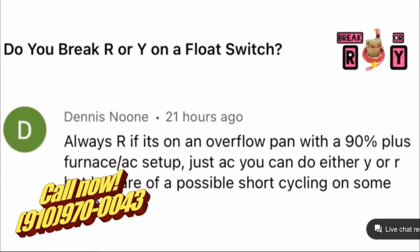The second point he was making is beware of possible short cycling. This shouldn't be very common, but on a system that doesn't have any kind of delay timer between cycles — whether on the thermostat, relay, or circuit board — if you're on an older system or one that still has a mercury thermostat, you may have an issue with short cycling. If you have a line float switch, like on the P-trap, and the P-trap drains out a little bit and it goes on and off repeatedly — it's just a slow drain, not a full stop — you could have a short cycling issue.